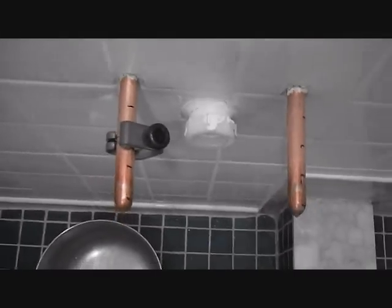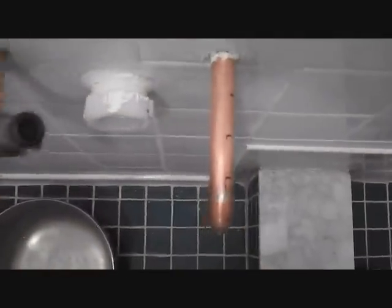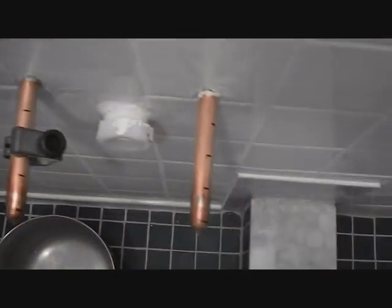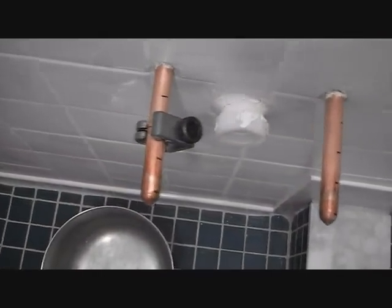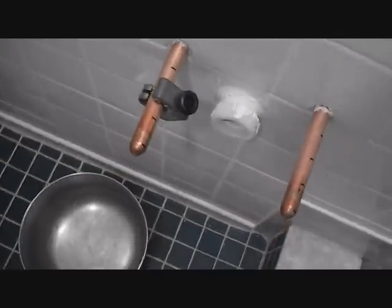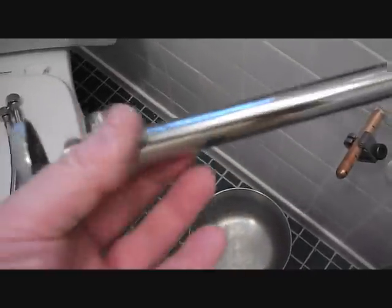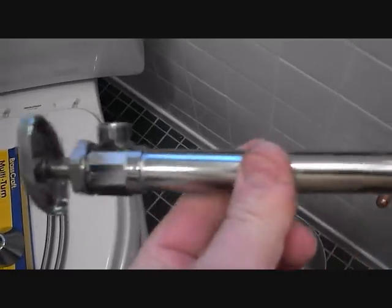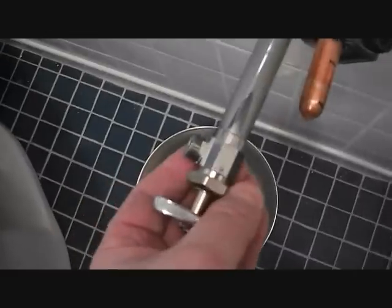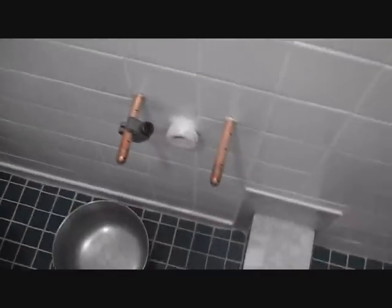So what I'm doing right now, while it's still kind of daylight outside, is I'm going to cut these guys off with my Mickey and solder on my service valve. I'm going to cut this guy off and then I'll sweat it up — cut both of these and sweat it up. I'm going to do the math, figure out the geometry. I'll probably have to cut these guys off right about here, and this valve needs to be right about there. I'll show you.